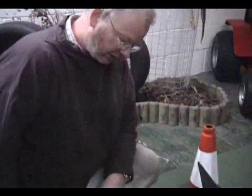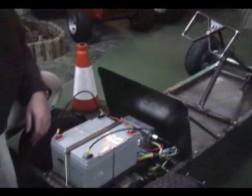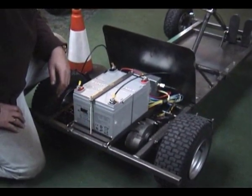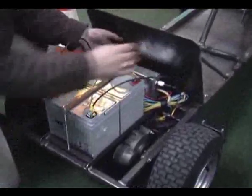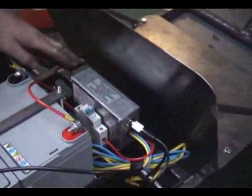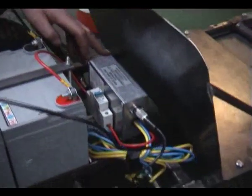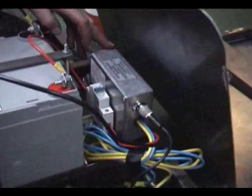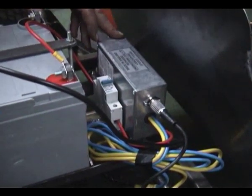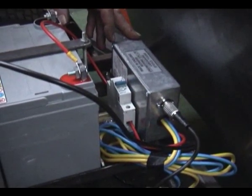The machine runs with a potentiometer throttle. It has a drive which is capable of producing 60 amps. This unit here is the drive — this is really the black box — the electronics inside which allow the throttle to ramp up and build up the speed slowly from 0 to 6 miles an hour. It doesn't allow the batteries to give all of their power at once, which would in essence burn the motors out.